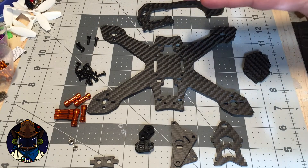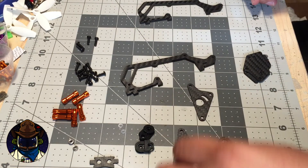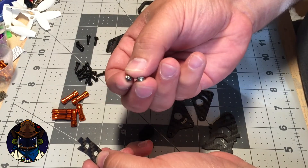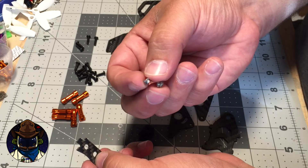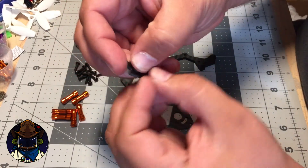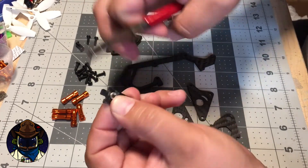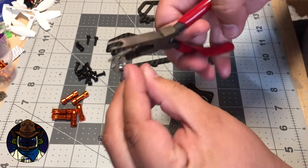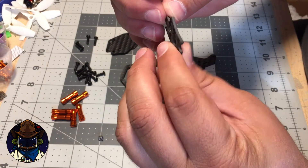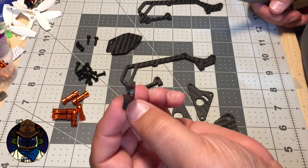Let's start with the roll cage. The first thing you want to do is prep the nut plate. You'll get these little sunken nuts — press nuts — which have a knurling on them and press into the holes. You'll have two nut plates to build, each needing two nuts. Take them, stick them in the hole, and then with a set of pliers or a small mallet, press them in on a flat surface. They shouldn't be too tight — just enough friction so that when fully seated they can't spin. Put both nuts on the same side.